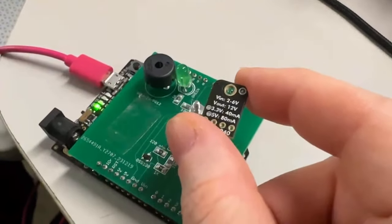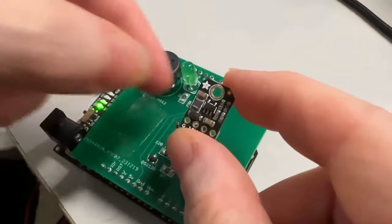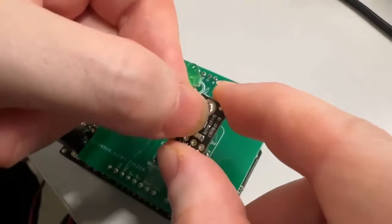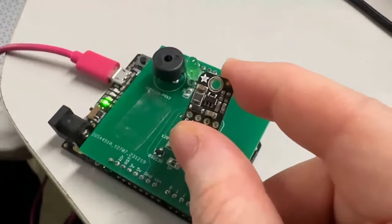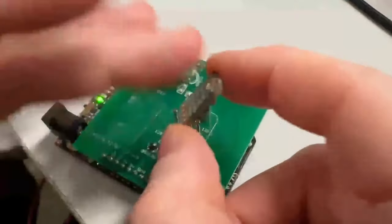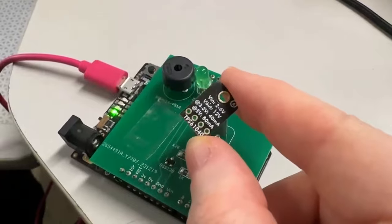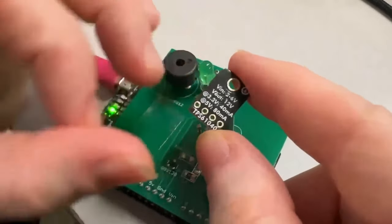This is a design I did a while ago where I made a mistake — I accidentally placed a 100 ohm resistor instead of a 100k resistor. These were remade and repaired. This is the TPS61040, a little boost converter I use for OLED boards to generate the 12-volt bias. I thought it would be nice as a little breakout board.